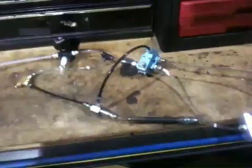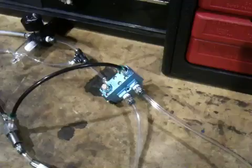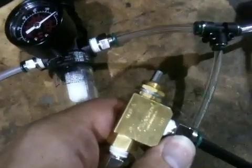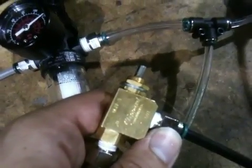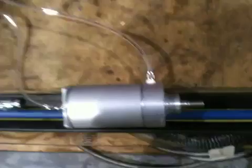This video demonstrates Clippard's PV-1P pulse valve used with a MAC 912BRA remote air piloted four-way two-position valve, used with a Clippard small three-way push-button or cam-actuated valve. This would be a small press stamping application with a generic cylinder used for demonstration.